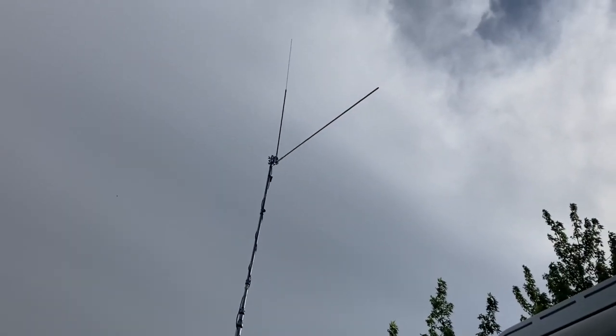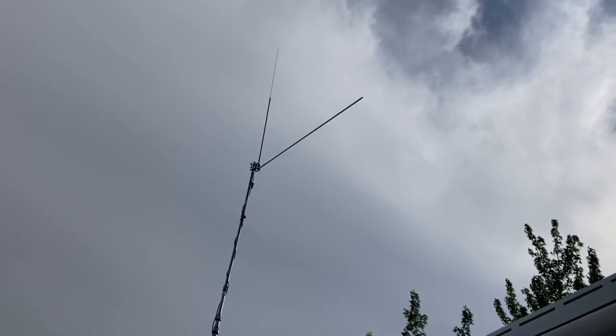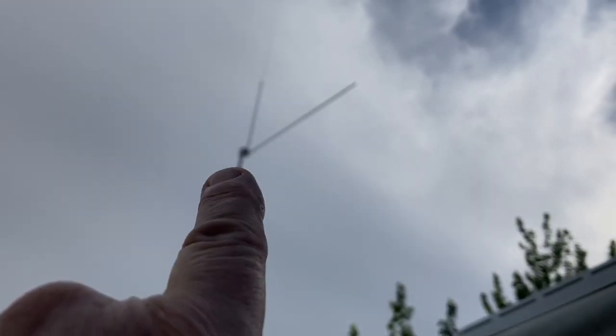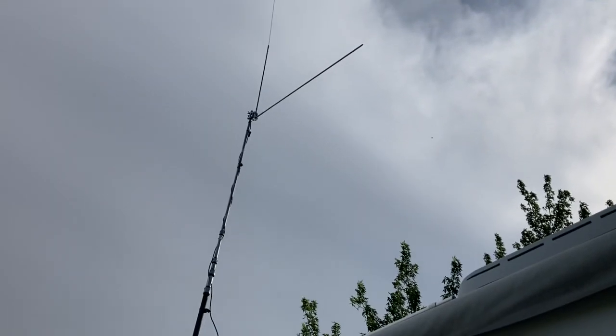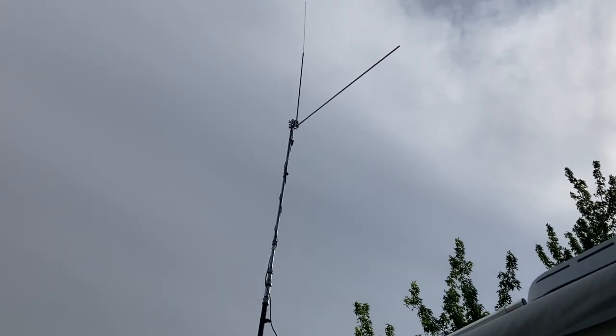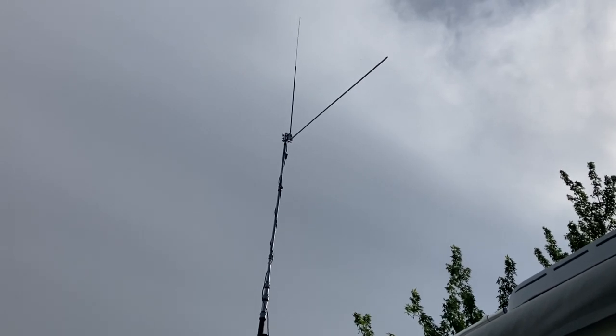There she is — it's basically almost the same as before. The MFJ 10-meter ham stick is here, and there's a fire stick coming out as well. I'll show you a close-up of how I did this. It works really well — getting about a 1.3 SWR with the amplifier on. I took the little mirror bracket mounts you get for mobile antennas, two of them, and that's what I used to mount these antennas. The fire stick is of course the ground, and the shield of the coax goes to that.